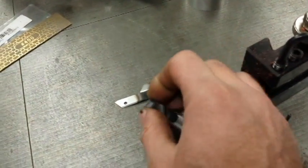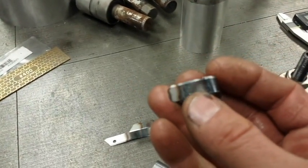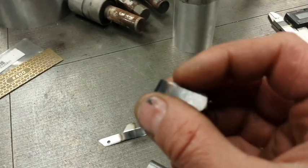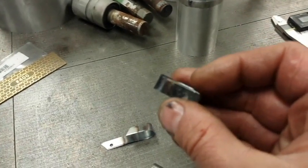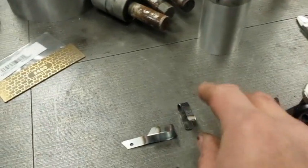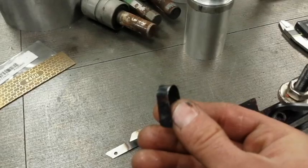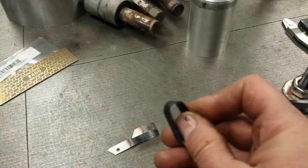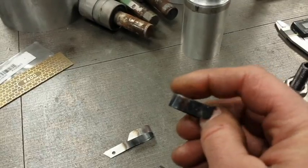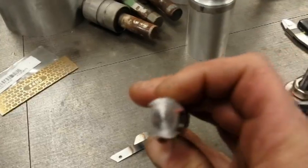I hope I don't cut myself here. Basically it's a little exacto blade that I bent, heat treated, and gave it an annealing. I don't know if it was worth anything scientific — no measurements taken — I just recolored it blue. As I said, I resharpened the edge slightly just to give it back a nice sharp edge. And I ground the ends to actually make them fit in these little pockets that I milled out here.